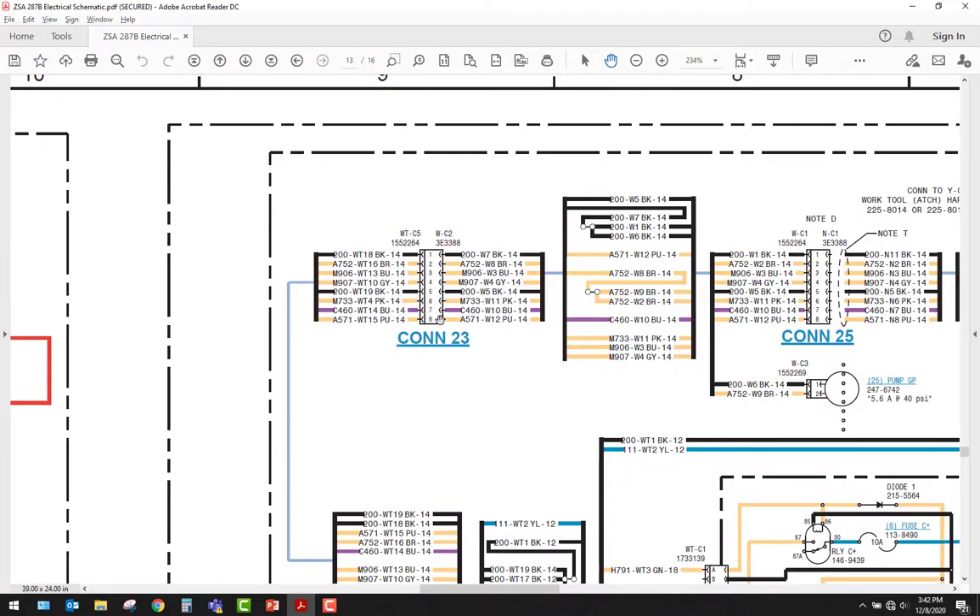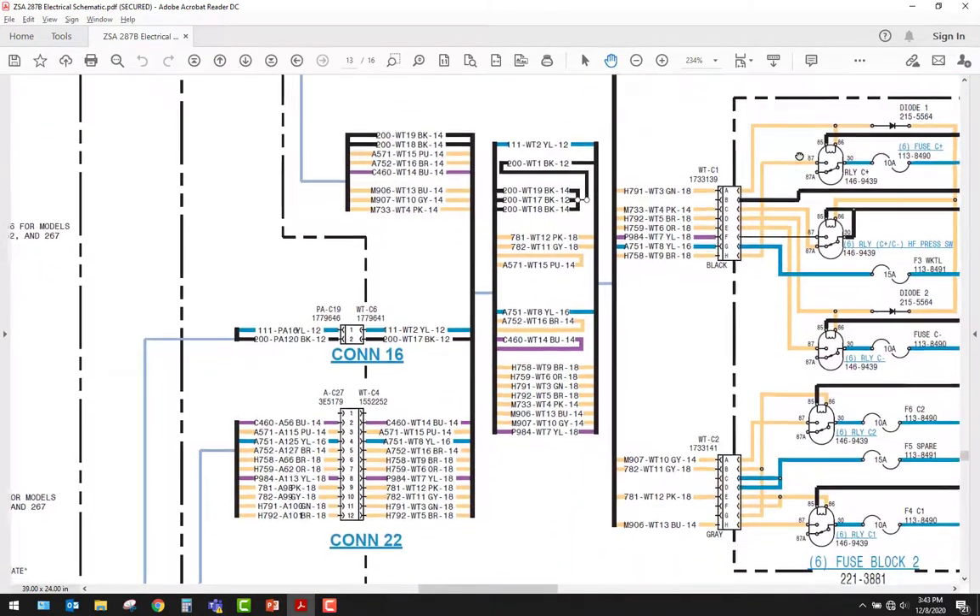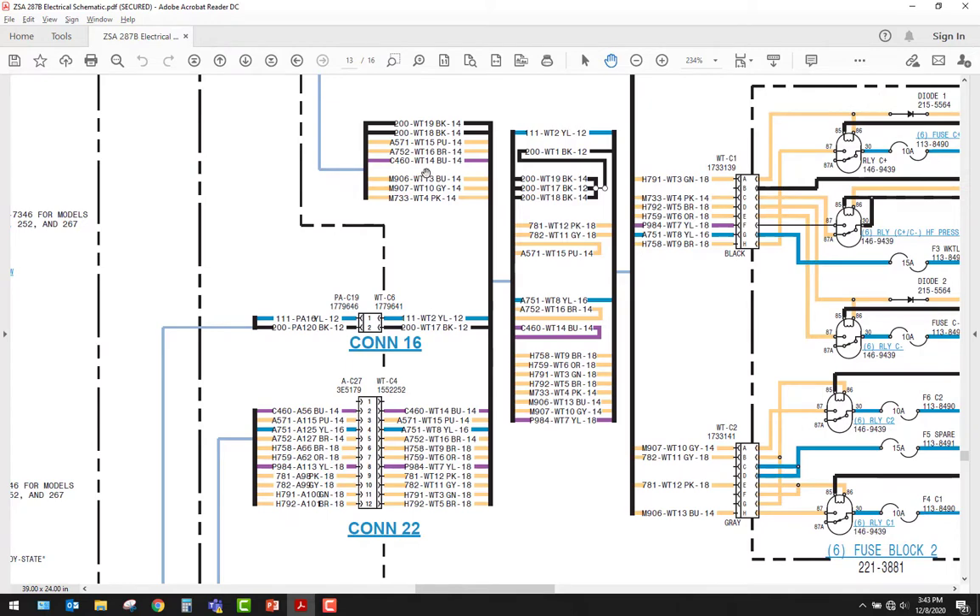Here are our connectors — there's an eight-pin connector showing what wire goes into which pin. This is the female connector side; that's the male side. Dots hooked together generally just indicate a junction. The way Caterpillar does their schematics is all of these wires running into this black bar symbolizes going into a harness; the little blue line shows the harness and this is where the wires come out. So if I wanted to follow wire P984 — it's a yellow 18-gauge wire — I come up, it goes into this harness, and I find the same wire P984 yellow 18-gauge right there, and it goes back into the harness and comes out going to pin F of that connector.